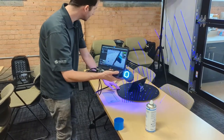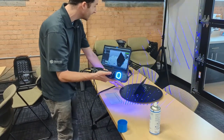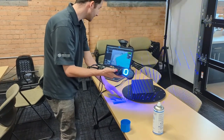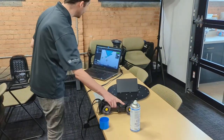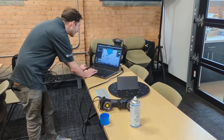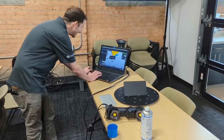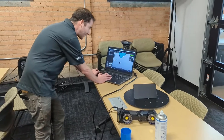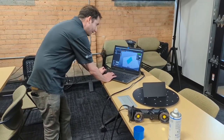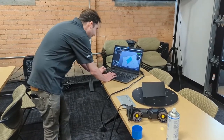Sometimes we get asked: does the ambient light in the room matter in terms of scan acquisition? Like if we had something outdoors that we wanted to scan, do we have to make any special considerations for bright sunlight? With this laser scanner, the answer is no — that is not something you need to worry about. In fact, one of the really cool applications would be inspecting objects that are outdoors, too big to bring into your facility to put on a CMM table.